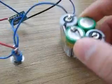And that's it — that's how we measure the current going through the laser diode driver. That small square silver port right there is where we adjust the current. We can turn it up by turning the knob clockwise, and reduce the current by turning the knob anticlockwise.